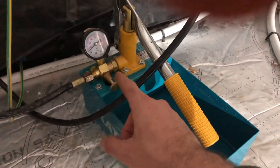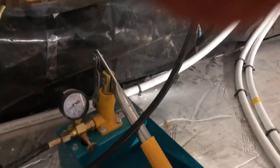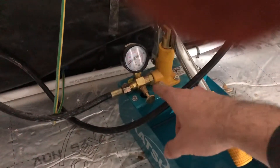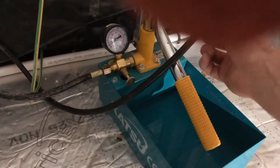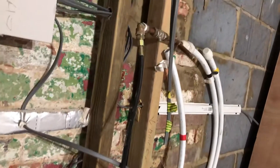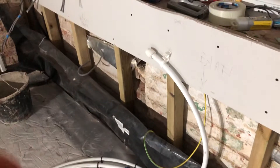I've noticed that the pressure gauge on this does drop off slightly, so if you close your valve off, come back and turn your valve back on, you might see your pressure gauge go back up - which means it must not have tightened all the joins up, so obviously a little bit leaky from there. That's why I've put that valve on as well, which I found particularly helpful. The other good thing about this is once you've built the rig, you can pick it up, take it over to your hot and cold, and test those too - it's a nice easy system to swap over.